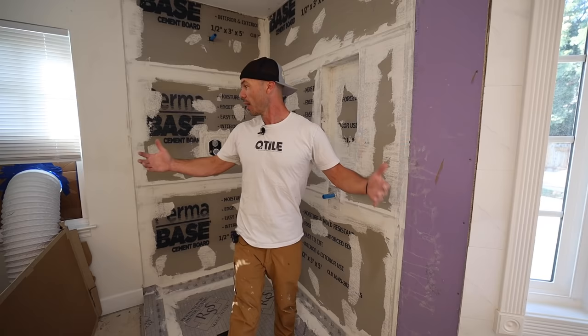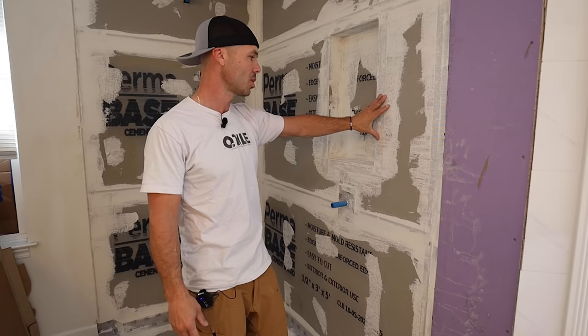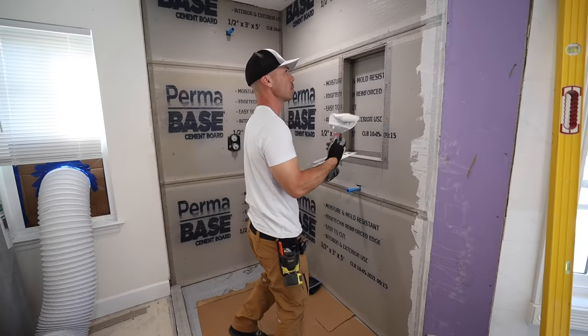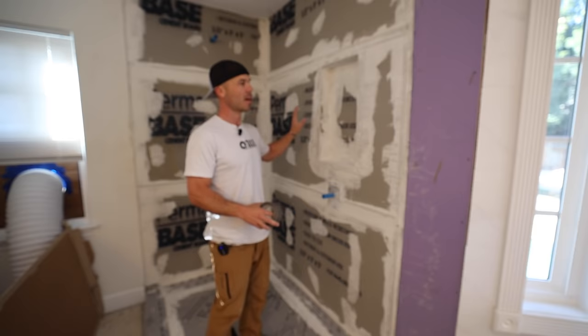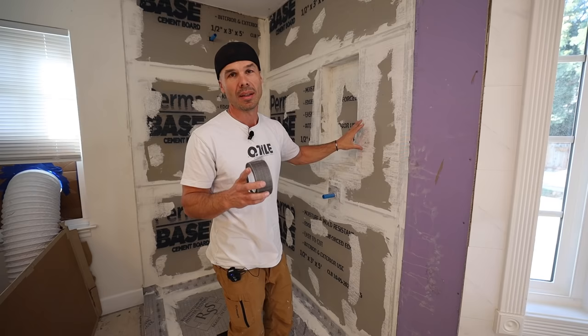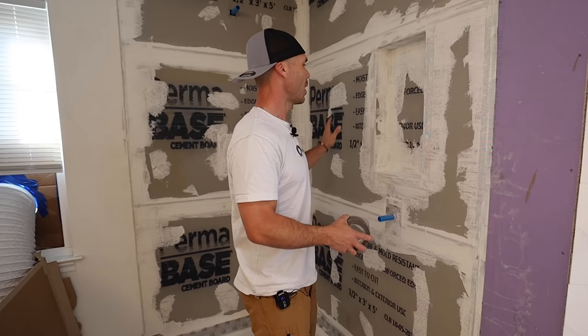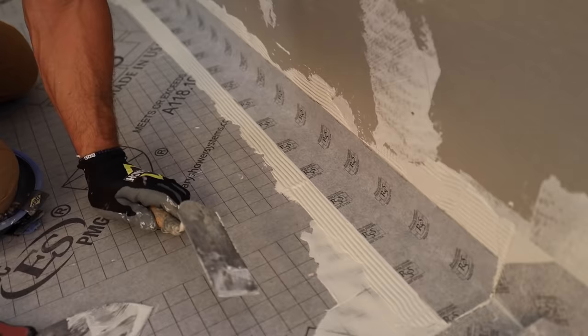I have nice, beautiful, plumb flat walls with the Permabase cement board. I have used mesh tape in all of the seams, corners, and transitions. I used MultiMax Lite to embed this alkali-resistant mesh tape. The MultiMax Lite is awesome because it's almost like a mix between a thinset and drywall mud, so it's really easy to apply — goes on really thin, doesn't have sand in it. I use it for putting in sheet membranes and also for going over mesh tape on cement board. It finishes up really nice.